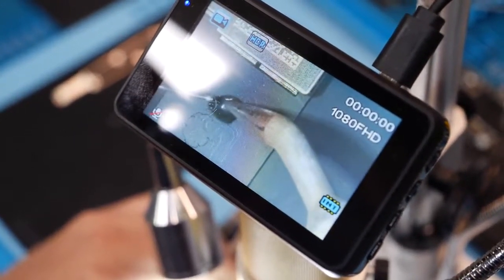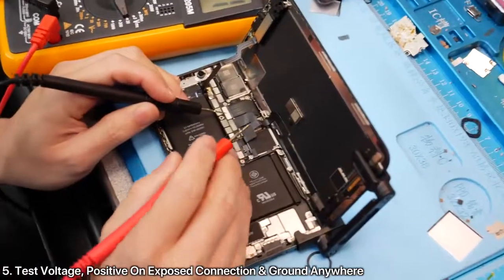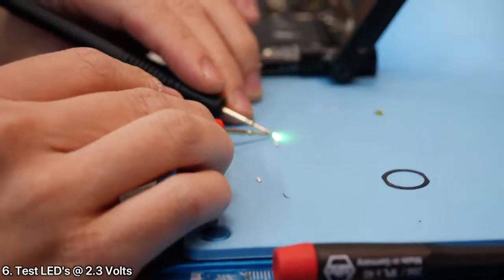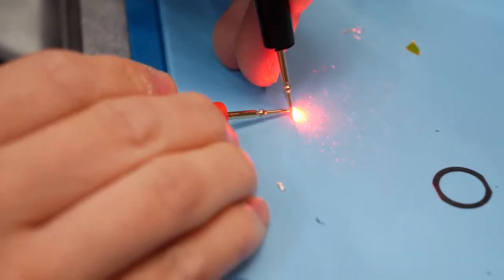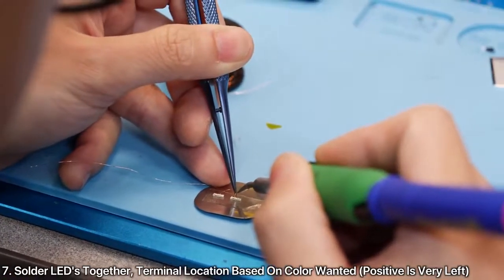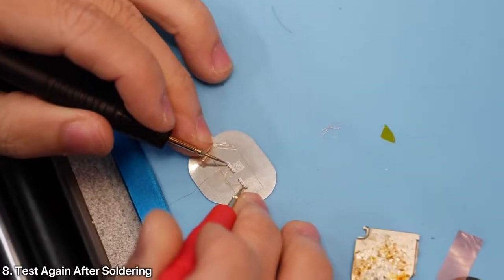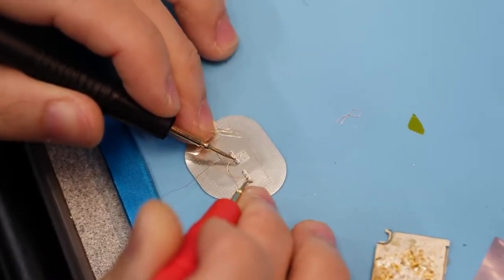Apple really doesn't want you tampering with the inside of your iPhone X. The iPhone 8 Plus and 8 have basically the same methodology as the iPhone 7 and 7 Plus. Next, add a little flux onto that connection point and a dab of solder so we can connect to it later, then test it — it should read 4.6 volts. The negative can go really anywhere in the case. Test the LEDs next — these are from the light-up Apple logo kits for multi-color, very nice and bright, the only ones that would really work with this mod. Daisy chain them together, and depending on which color you're going to use, you'll use a different connection point. Use a multimeter to test which color combination you want — and if you guys aren't overwhelmed yet, do consider that this is the easy part.